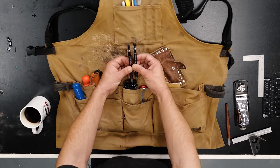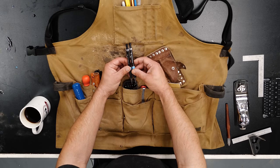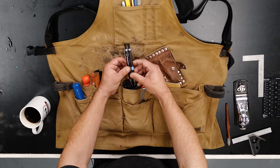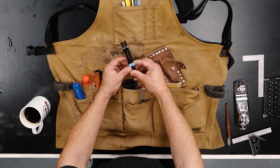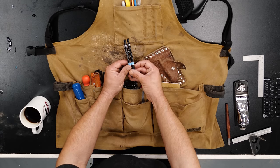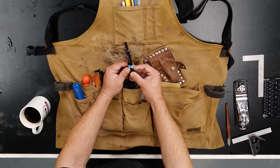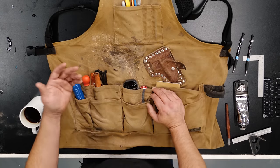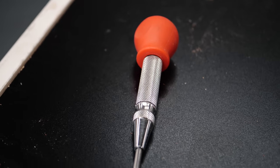I got this tip from the Samurai Carpenter and he was right — it's indispensable. It's great for quickly measuring in the middle of boards without pulling out a ruler, and it's square and straight. My pencils are mechanical — I have a 0.5 and a 0.7. The 0.7 works much better on rougher lumber I haven't sanded; the 0.5 is for fine layout when I'm not using my marking knife. They're about the same price — for around eight bucks you get six of them and enough lead to last forever.